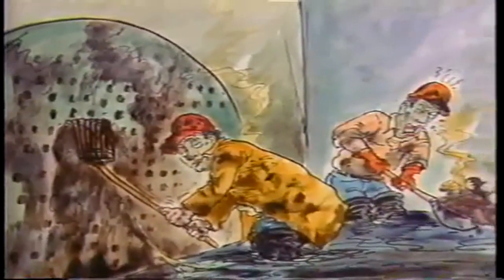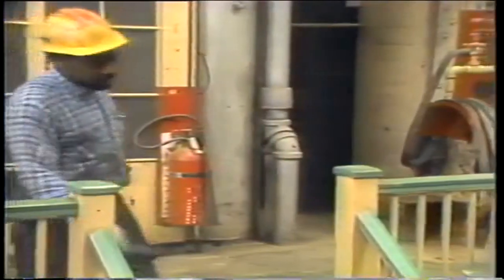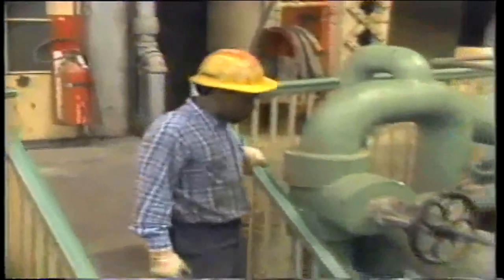Now, when a heat exchanger is out of service for routine scheduled maintenance, the first thing needed is a thorough cleaning. With surface heat exchangers, condensers, and other shell and tube units, this usually means cleaning out the water boxes or headers and clearing the tubes of any blockage. Cleaning and inspection is also done with direct contact heat exchangers.